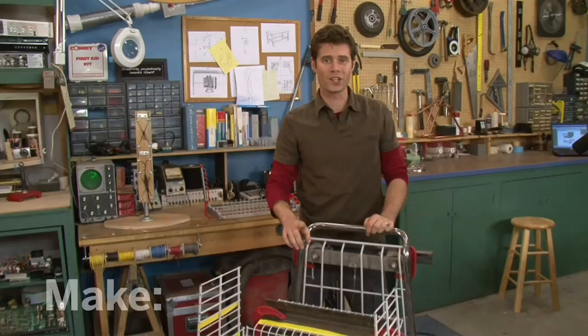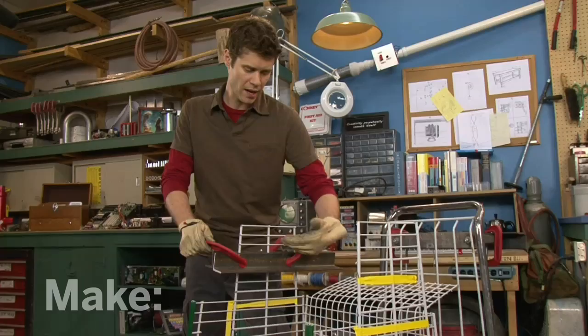This is going to be the fulcrum of the armrest. You can only do this once, because once you've bent it, this becomes work-hardened steel — if you try unbending it, it might break. I grabbed some gloves to make this a little easier, and now I've clamped for the next bend. This is the front of the armrest.